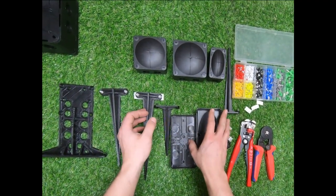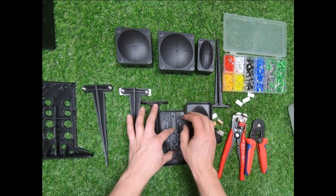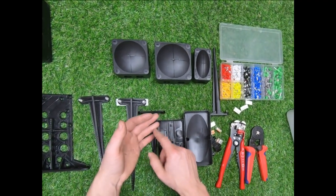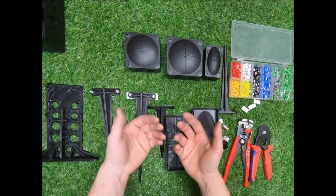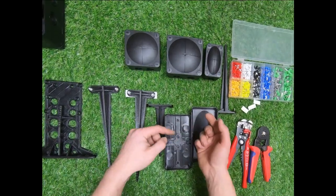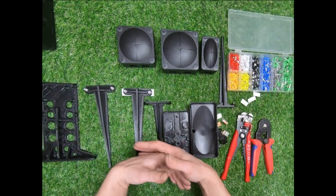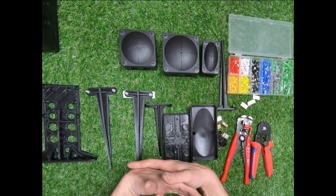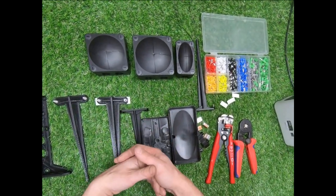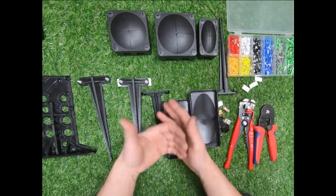So on to mounting options. Most ideally, if possible, you would fix your boxes to a solid structure — a brick wall or a fence, if it's owned by the person you're working for. It's kind of a grey area fitting to a neighbour's fence, because if they have to replace their fence they've got to take all your wiring off. Fences aren't particularly great to mount to since they need replacing every so often. But brick walls and rendered concrete walls are the best things to mount the boxes to.